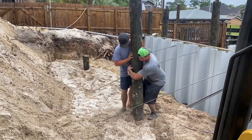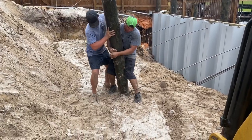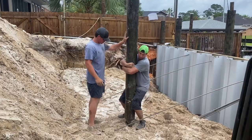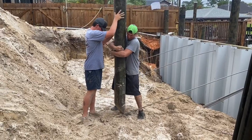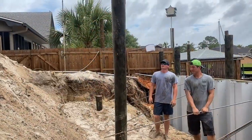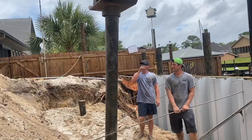They're pretty heavy — that's sand on them. The tieback pilings on this wall are 8 inch by 8 and 10 foot long. We want to go ahead and go with some larger pilings to really give some good support to this wall. The front face of this wall is 8 foot exposed. Tieback rods are 5/8 inch by 12 foot long. The tieback pilings are being vibrated in the ground. This will give you a real good, tight, secure support for the front of the seawall.